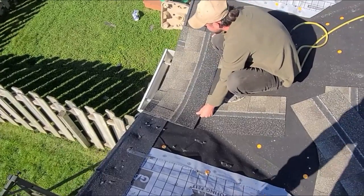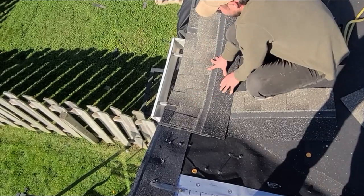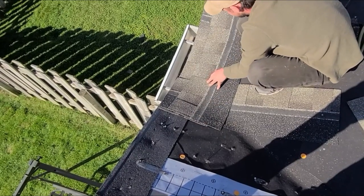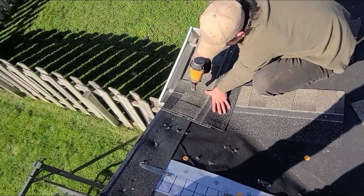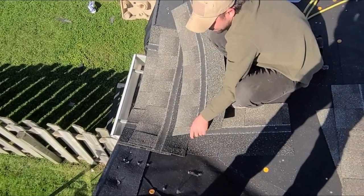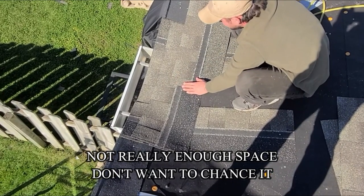Just because there's a lot of snow here, I'm going to drop this reveal quite a bit — see how I'm only doing about half in here, if that even. Before I move on, I ran these shingles here because we're going to have to snap a line on this side now, and we need to make sure we're going to cover that. It's kind of like the weave. Just do this for a second — double check where my seams are going to go. I'm going to put one in the center here. There's not enough headlap for another one — this one barely cuts it. So I'm going to be putting one here. I probably won't even nail this one. These things are super safe and I'm going to burn the reveal a little bit on this one as well.